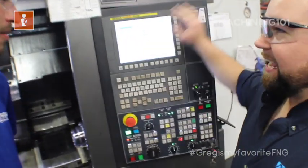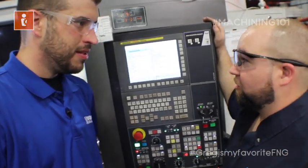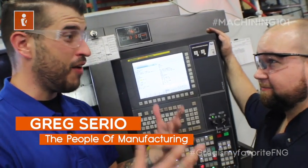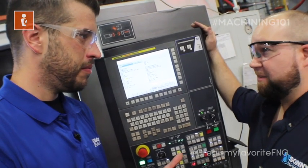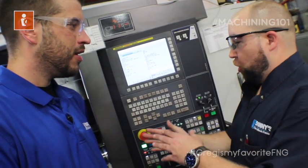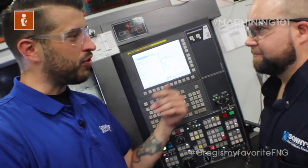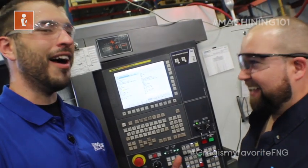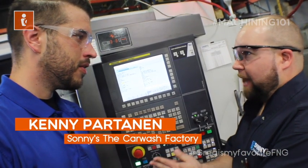So we're spinning at 2850 RPM, which when you calculate it out is 350 SFM. You're throwing a whole bunch of three-letter acronyms at me. So you have SFM and RPM — how do I know the difference between the two? RPM is revolutions per minute — you see RPM in cars and engines. That is the speed of how many revolutions per minute your chuck, which contains your part, is going to be spinning. It's kind of like when I put 26-inch rims on my Hyundai Sonata and it messed up my odometer. Exactly. So RPM is a direct output of how fast that part is going to be spinning.